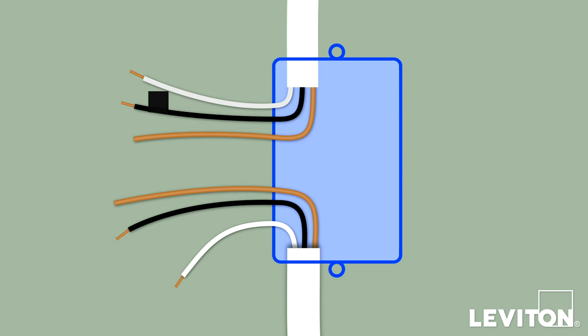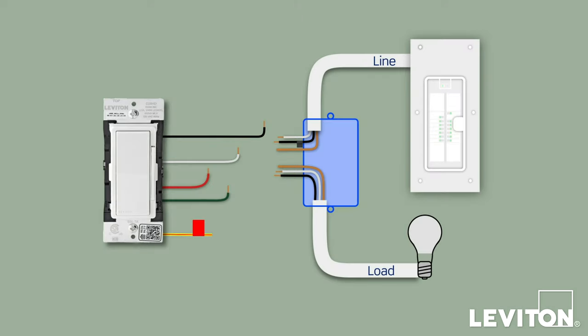Next, you need to be sure that the wires are prepared for installation. Start by making sure the wires are straight and stripped. If not done so already, separate the white neutral wires. Take the copper ground wire and connect it to the green lead on your dimmer or switch, using the included wire connectors to secure the connections. Give the wires a tug to make sure they are firmly held in the wire connector, and dress with electrical tape to ensure stability.